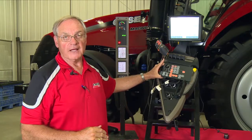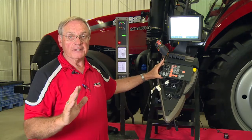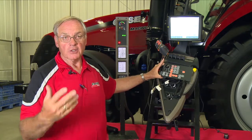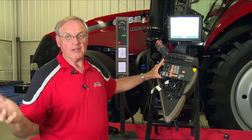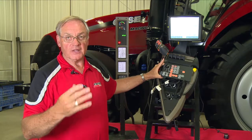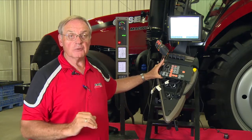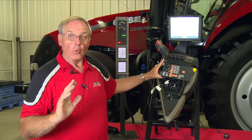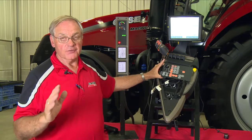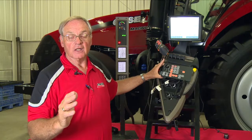What it provides is a savings, especially in fuel economy, and it allows the tractor and its computers to operate in its most economical means of operation. It's always trying to maintain 100% power level on the tractor within the speed range you have selected. One of the negatives of using the APM system is that some people don't like the way the tractor is constantly shifting.